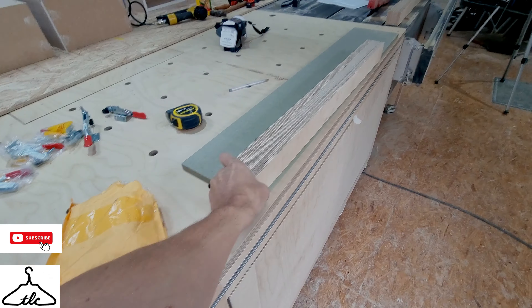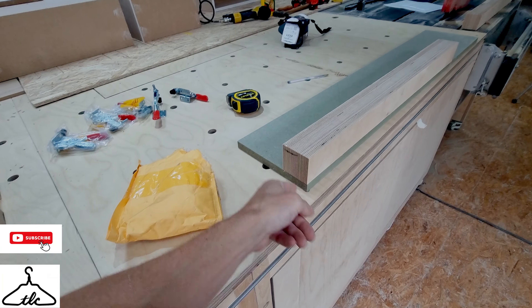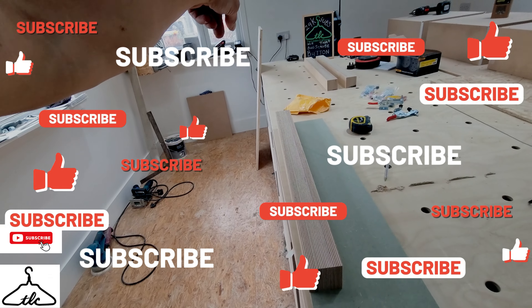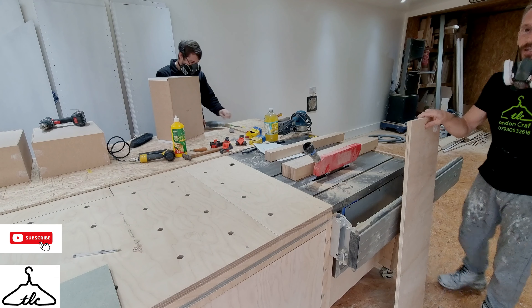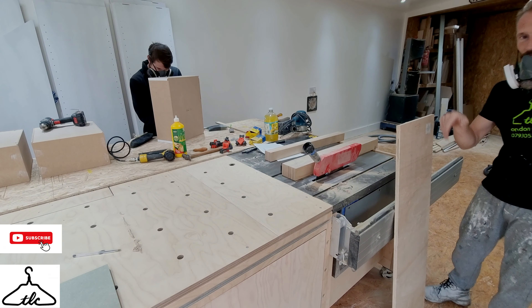So here's going to be my base. We're going to line it up with one front edge of the sled and we need to make a fence here, out of strips of ply. We're going to be ripping them down on the table saw, screw them together, and then screw them onto our sled. So I'm going to rip this ply down into 60mm strips — three of them — then cut them to length.